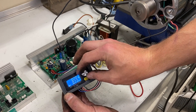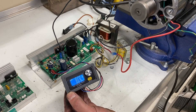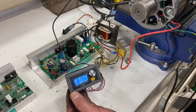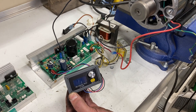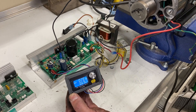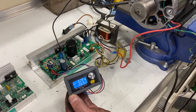To vary speed, we just adjust the knob. We can get quite a bit of speed. At any point we can turn it off and it will wind down — there's a fairly large flywheel on the motor I'm using for this demonstration. We turn it back on and it comes on. Now, we have soft start, so if I turn the master power off and take a minute for the capacitors to discharge, everything will turn off. When we turn the power back on, nothing happens — this is the soft start feature. You could turn the knob all the way to the slowest setting and back up. But here I just turn it off and on again to bypass the soft start and go back up to the last setting it was on.